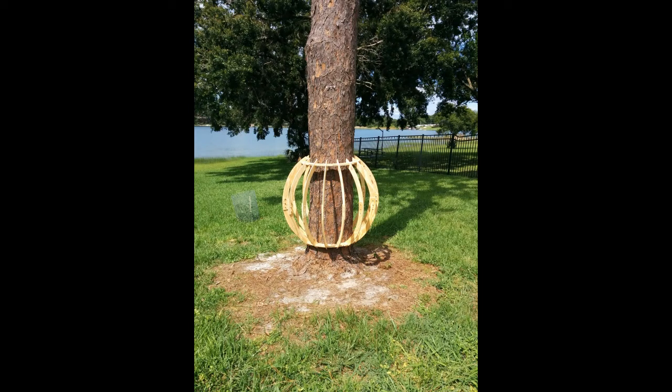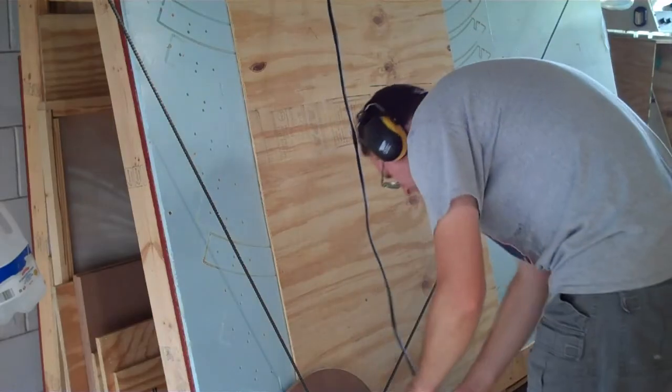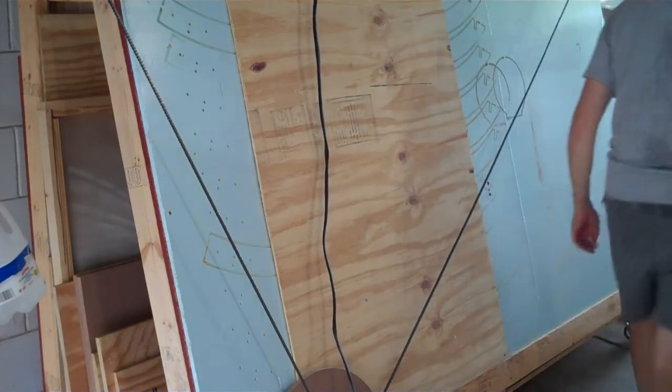A few final notes on safety: you must attend the machine while it is working. As with any CNC machine, you have a high-speed bit cutting flammable sawdust out of flammable wood. If something goes wrong and the bit stops moving, the friction of the bit can easily start a fire. This has happened to other CNC machines and has already happened to at least one person's Maslow. You should also invest in a pair of ear protectors, as being in the same room as a router running for hours along with a vacuum and dust collection system can do some damage to your hearing.